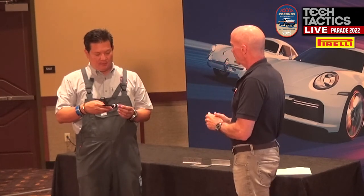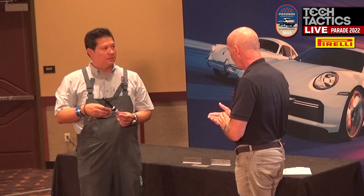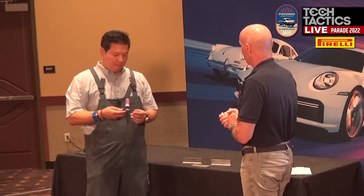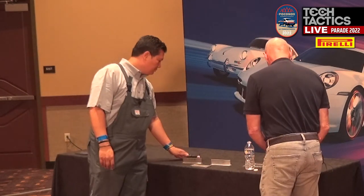With TIG, the really cool thing is I can just keep the arc going without putting wire in and just hang there — maintaining the puddle. Then I reposition my body as a welder, go back at it again, keep the arc lit. I've got complete control over the process. This process can weld pretty much anything: titanium, copper, aluminum, steel — very versatile. Can't weld plastic, but that's the TIG process.